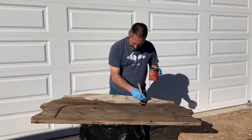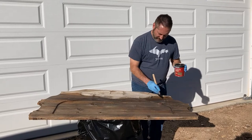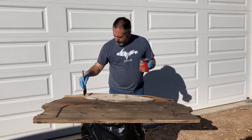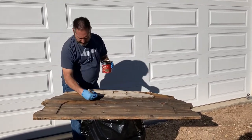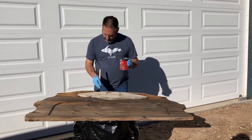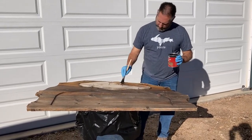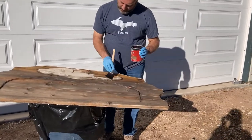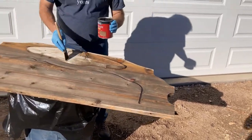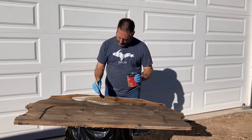I don't know how old this headboard was. I can tell by the way it's made that it's probably older than the 1970s. The boards where they put them together in the middle had dowel rods or wafers to keep the seams and joints straight and tight. They cut notches into the planks, and then they had the holes to go into the uprights for the bed frame. That's not something that's been done on any or most modern furniture.